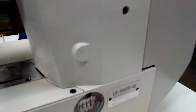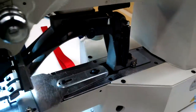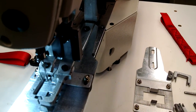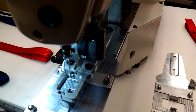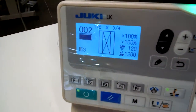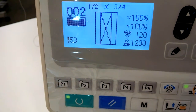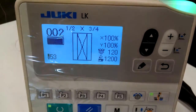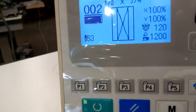This is the 1900B series and we're going to do several clamps on this, basically doing some tacks on the end of some webbing or rope-like webbing. The first pattern here is an inch and a half by three-quarter boxing cross pattern, just to give you a familiarization with this machine.